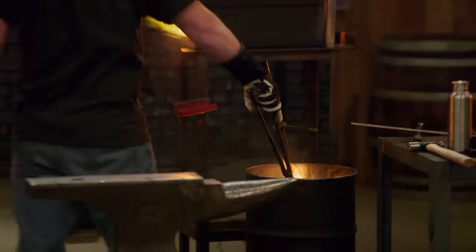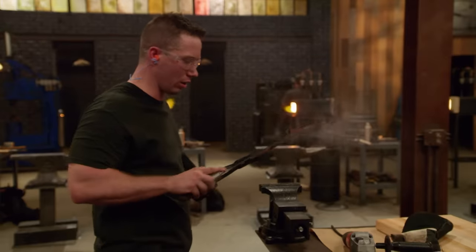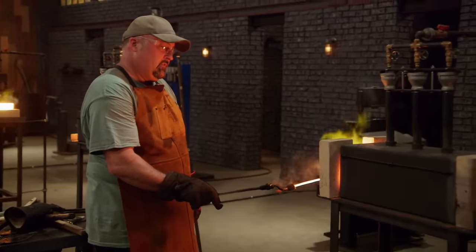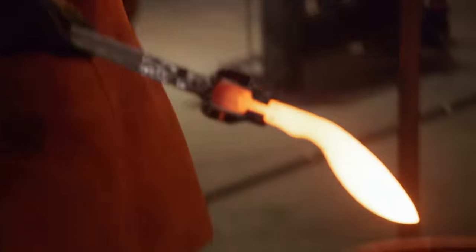That's smart that Daisy didn't harden the whole blade — because when you forge in one of those rings there's always a lot of cleanup on those. I'm hoping that nothing went catastrophically wrong. I don't want to pull out a banana. I bring it out and it's just perfectly straight. It's time to quench. Never having quenched W1, I'm very concerned about the temperature of the blade. It's hotter than snot — that is no bueno. I have a soft spot in the recurve portion of my blade. I bite the bullet and do it again. Hopefully it's going to harden.